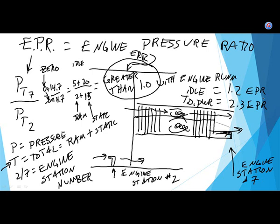Well, what the pilot's going to do on takeoff is push the power lever forward, and watch that EPR gauge. And when it gets to the takeoff power setting for that day, then they're going to stop moving the throttle. If they push the throttle forward and the gauge never gets up to takeoff power, they're going to go, I can't get takeoff power. I better not take off. And they're going to pull the throttles back, and put on the brakes, probably use thrust reverse. They're going to abort the takeoff. So they're not going to get off the ground unless they see the needles show takeoff power.